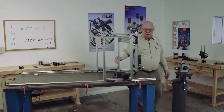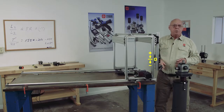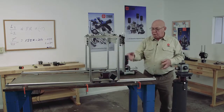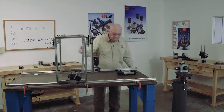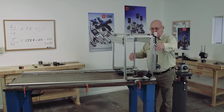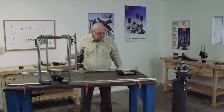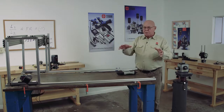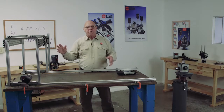Let's check the flatness of the x-y plane. The target is standing up, so a plus number means it's high and a negative number means it's low. We're going to make target number two zero. Here I'm at plus eight thousandths — I'm looking at target number two, I keep the target aimed back at the turret. I know this is rising up. Plus 14. Minus one. Plus six. Moving over to the middle — again, plus six. Plus six. Minus nine. Minus 17. What I'm looking for here more is roll, though. Some of this issue is because this machine has some roll in it, so I'm not going to get good repeatability because of twist.